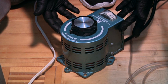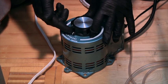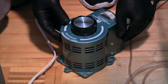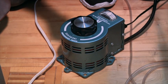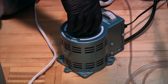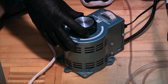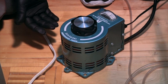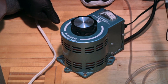This is where I have my Variac installed. It controls the actual speed of my vacuum. For cutting lacquer, I have it on a relatively conservative setting. When I go to cut plastic, I generally turn it up — usually right around 75% or so. You can hear this is literally slowing down or speeding up the speed of the blower motor for the vacuum. For cutting plastic, you want to be aggressive more so than you would be for lacquer — it just works out better.